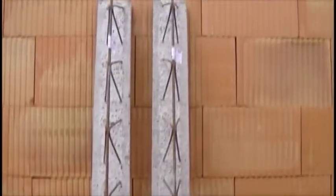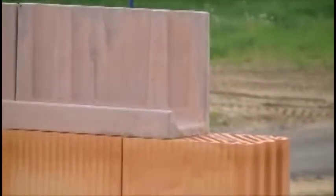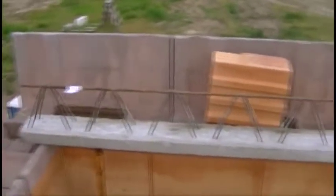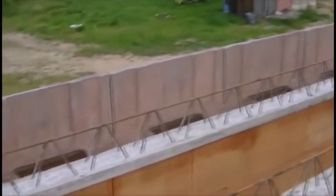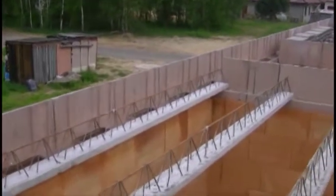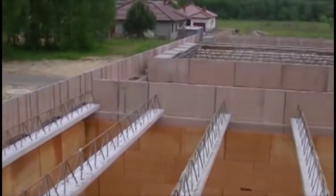Formwork should be put with masonry cement mortar class B10, however, due to the fact that I wanted to get the ideal plane of the upper surface of the walls, I decided to use polyurethane mortar, and as you can see the effect is very satisfactory. It is another perk obtained with the execution of the wall in the polyurethane system. I was able to save quite a bit of time and money associated with the preparation of mortar, and I gained what I like the most, that is simplicity combined with precision and clarity. Those are the basic ideas of the creation of this course.